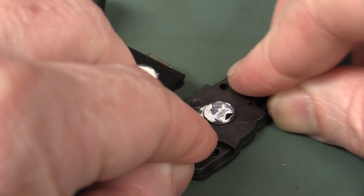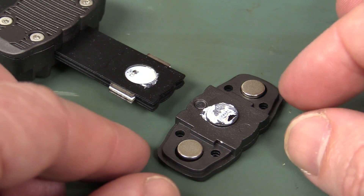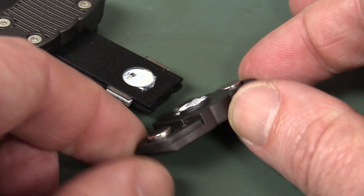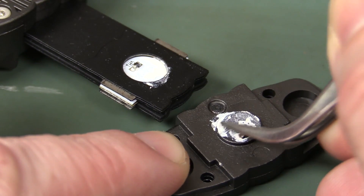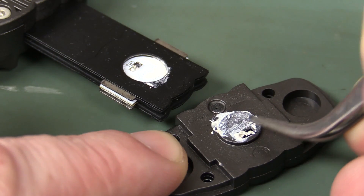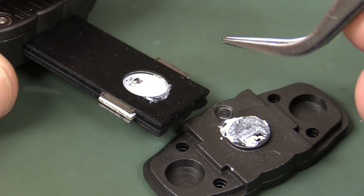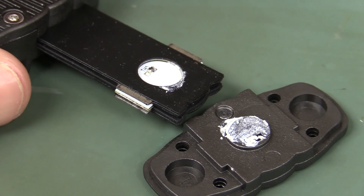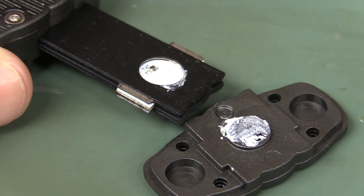The neodymium magnets came installed in here, but when I opened them up they flipped out - they're so strong. My only complaint is that the thermal compound they've used has gone a bit hard and flaky. It's hard to say if that's an issue. It hasn't had any use - it's not like it's gone hard through heat cycling - it's shipped brand new and hasn't been used. But one awesome feature: they've got an individual thermistor on each LED, and also a thermistor up here as well. Fantastic - that prevents individual LED overheating. Great attention to detail.